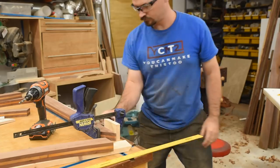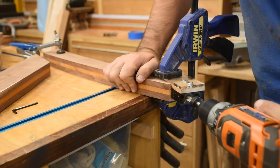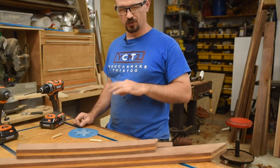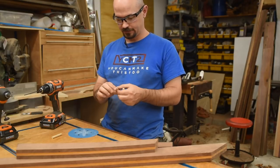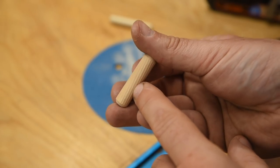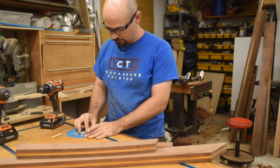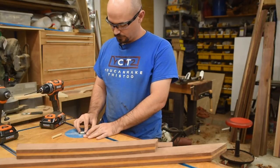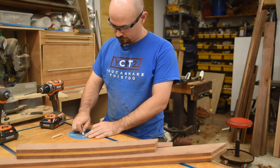To start the joinery process for these legs, I'm going to use dowels. I made some spacer blocks to make sure that my doweling jig is properly positioned and consistent on both sides. I'm using one dowel and one screw in each joint — I'll talk about that later because I know some people are going to disagree. I have some 3/8-inch stock that I'm making the dowels out of; I have some bought dowels but they're a little short for my application. You'll notice these kind of have flutes and they're also rounded — the rounded ends help them go in the hole and the flutes help carry the glue.